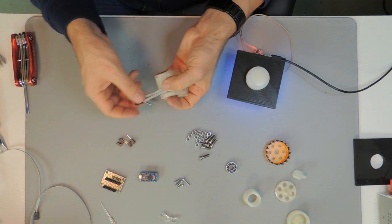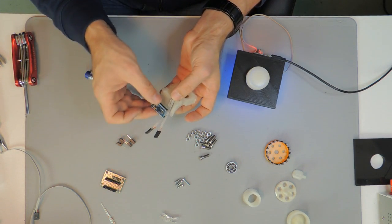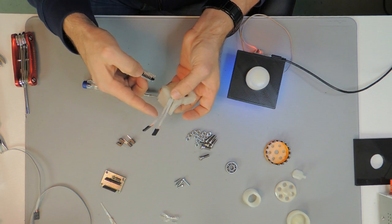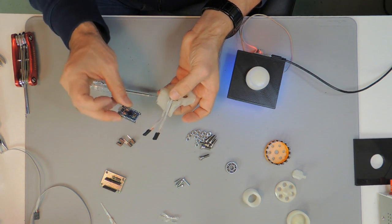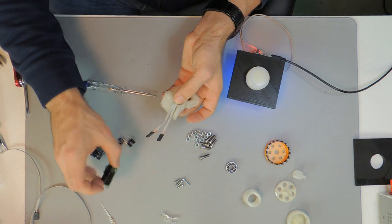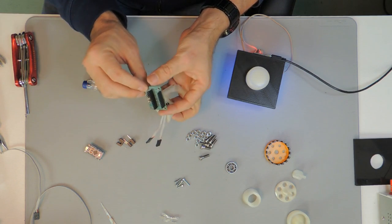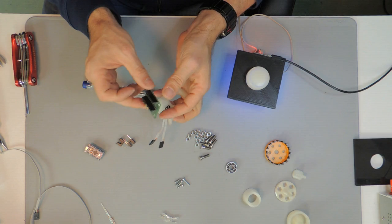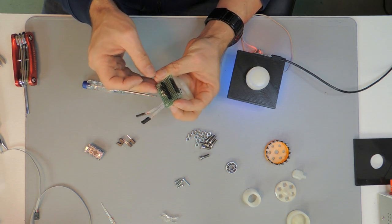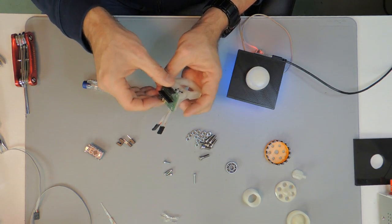When we install the microcontroller on the back, we don't do this directly. Of course we can directly solder all the contacts from the sensors to the Arduino and hot glue it in at the back, but I like to have things easily assembled and disassembled, and therefore I go with a so-called shield, which basically makes it a little bit easier to do all the wiring. And this shield, once it is soldered, can be screwed with 3 screws to the back of this device.